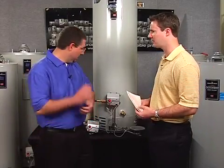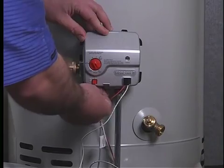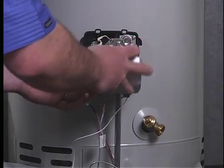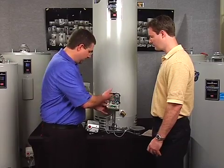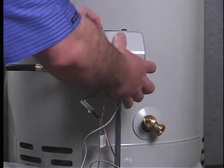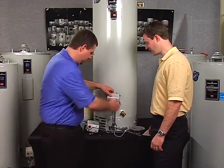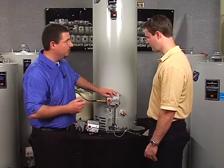To correct this, the thermostat sensor and the well are located behind the ICON control. Loosen and remove the single screw to access the inside of the control — be careful, there are wires connected. Slowly remove the control with a little wiggle. You can see the wire here should be connected — I've already set that up to show the fault. To show the simplicity: take it apart, plug the wire back in, put the control back in place making sure not to pinch any wires, top going in first. Make sure it lines up, reinstall the single screw and tighten it, confirm all connections, and go back through the lighting process.